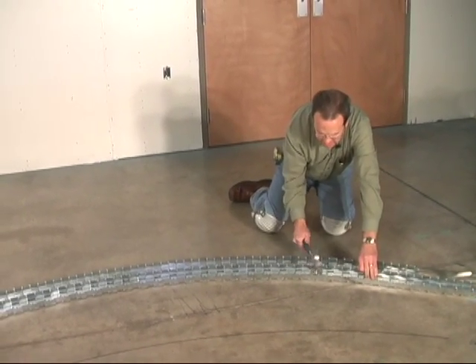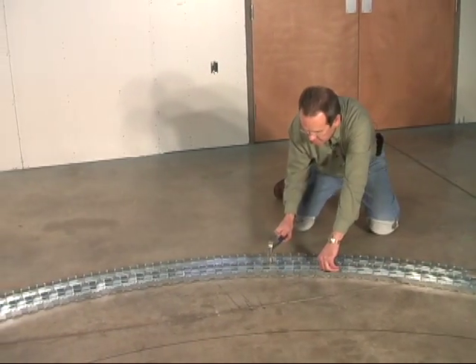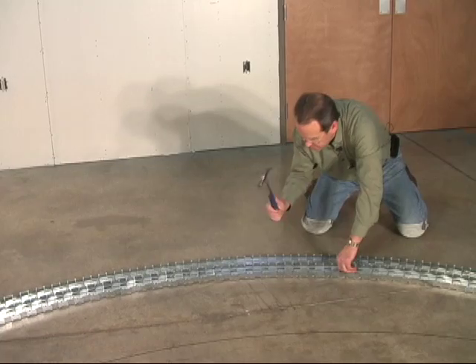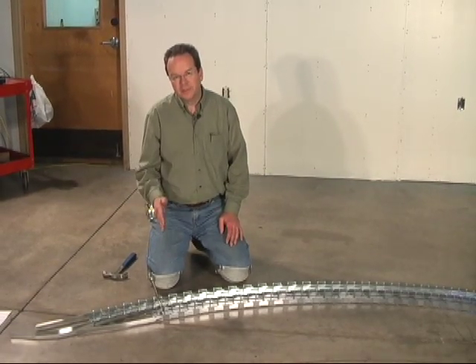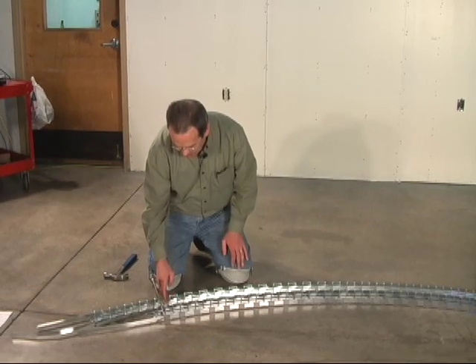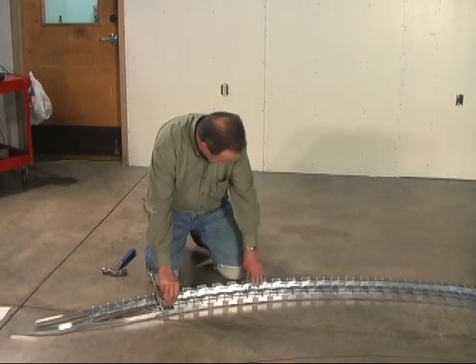Of course you'll need to go back, check all your hammer locks, and make sure they're done really well — smooth to touch, like we told you earlier. Now we've got the proper length of each rib marked on your template, but we need to transfer this mark over onto each rib so you know how long to cut them.